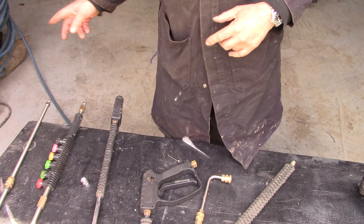I could never get it up to pressure or heat — it's a steam cleaner and I could never get it up to heat. The power washer was working great but the heater wasn't working when I got it — it was sold just as a cold water washer. I paid 900 bucks for it donkeys years ago, and all it was to fix it was the heater control rheostat — 35 bucks it was fixed. But with that lance I could not get up to any pressure.